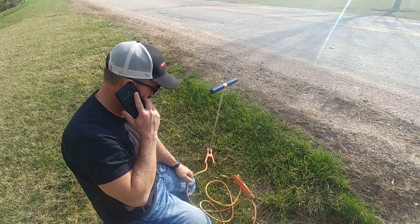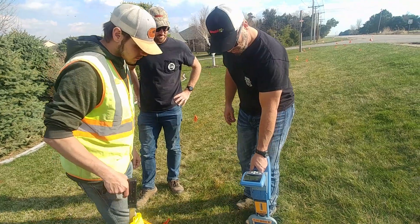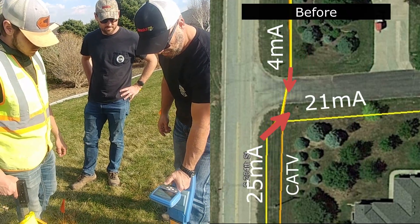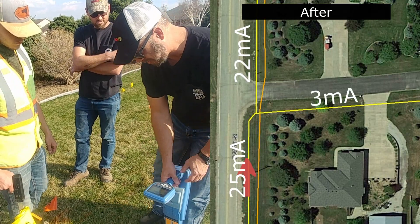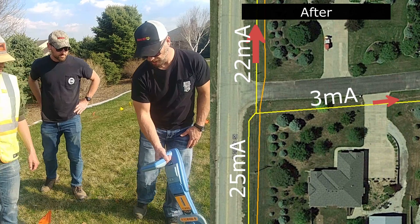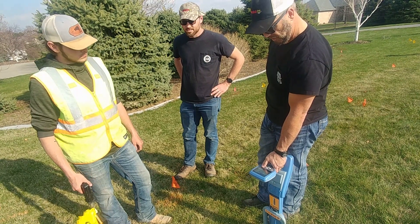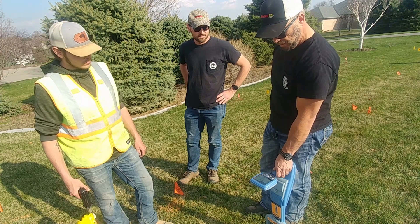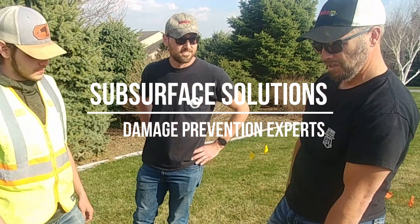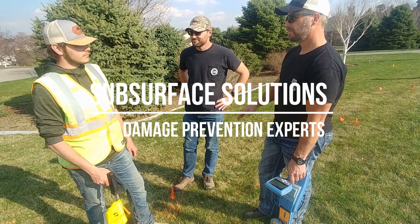You still there? Okay, I'm grounded down here. Let's go ahead and try the locate. Alright, we're on 512. Look at this — peak response is right there. Null response right there. If I go to guidance null mode, arrows are right there. Everything is within an inch or two of one another and we got nothing else. It's definitely a huge, strong signal. Depth reading is better — it's five foot, five and a half foot, five foot ten inches right there. And that's what it looks like in the bottom of the hole. Look at our current: 22 milliamps. You're good to go now. This is definitely a good locate. Using a lower frequency and grounding the other end of that wire made all the difference. Rockstar!